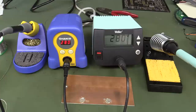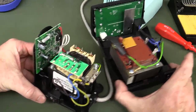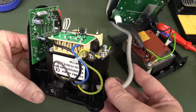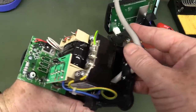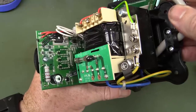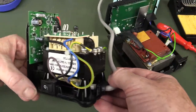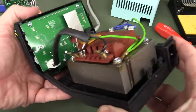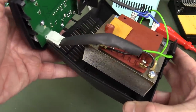The Hakko stand is absolutely better — no doubt about that. The Weller's stand is a bit dicky. The Hakko has presets but the user interface for adjusting temperature is more of a pain. The Weller is better for quick temperature tweaks but takes up more bench space. The Weller's iron feels better. The build quality: the Hakko is built like a brick outhouse — you can drop it. The Weller just feels less robust with its plastic snap-together construction. A quick teardown of both shows neat and tidy internals for each.